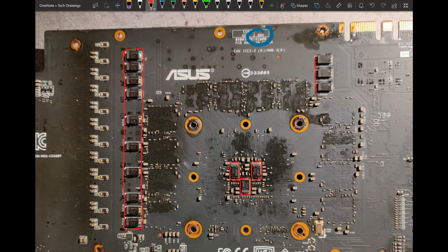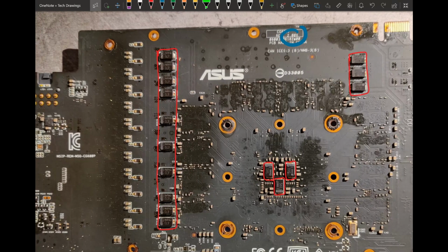And then over here that's the backside of the memory VRM. So the memory also gets a fair amount of capacitance, which I think is very nice. Like, you could still have put more capacitors here, or at least left empty pads. That would be really nice. I think a bunch of modders would just be delighted to see that.